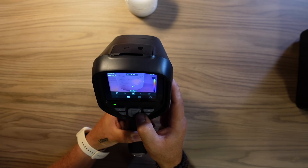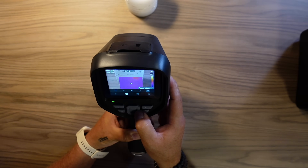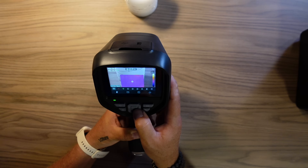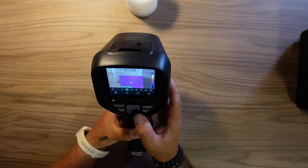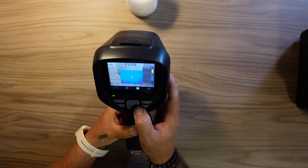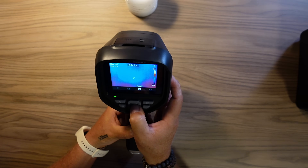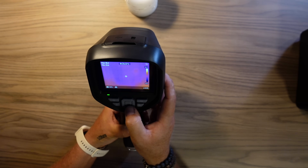We can go over to Fusion mode, which combines both infrared and visual image. Then we can go to Picture Mode, and then Fusion Alignment. Going back to Measurement, we have Center Spot, Max, Minimum, and we can create Custom Spots where we set more measurement points on the screen. Going back to Palette, you can choose different palettes. Let me change the Image Mode to Infrared, and then back to Palette: Lava, Rainbow, Iron, and so on.